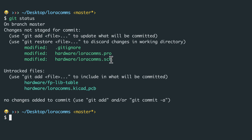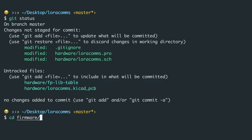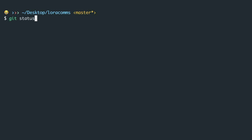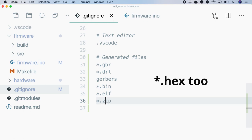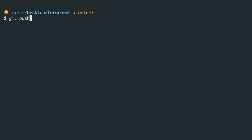One final git status confirms these are exactly the files I want to commit — the layout file, schematic file, and footprint library table file. I'm very sure this is the snapshot of the entire project to send to the PCB manufacturer. Creating the git commit: 'integrate LoRa and e-ink in PCB and firmware', and git push to GitHub. Via the folder directory, we see the build files for firmware and the Gerber files for hardware — but in the GitHub remote repository, we won't see the build folder inside firmware or the Gerber files in hardware.